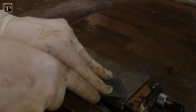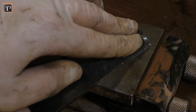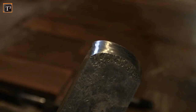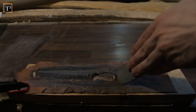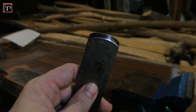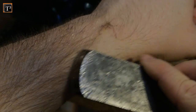Passing over to 400 grit I needed to get rid of the burr that started to build up. Usually one gentle pull on the back is enough to remove it. This works the same for 1000 and 3000 grit. Additionally I like to polish my blade on a strop — a piece of leather on a board with abrasive material rubbed on the top. I pulled back the blade with firm pressure while tilting it a bit on each stroke. This makes it shiny like a mirror, and the burr is removed just like on the sharpening stones before.